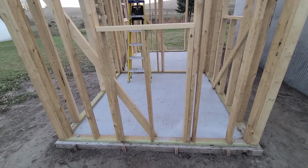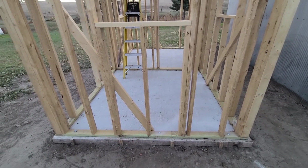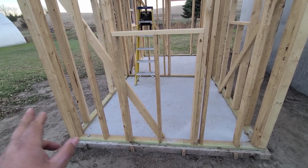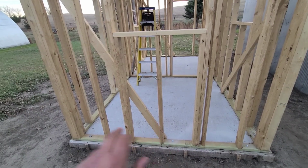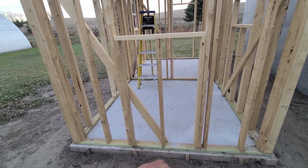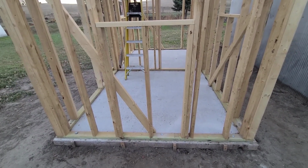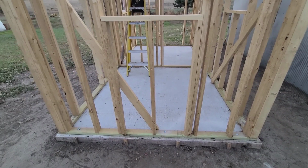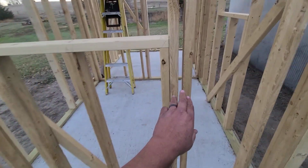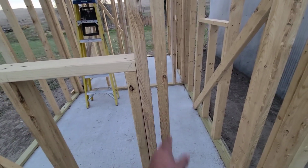So all of your buildings are either on a 16-inch center or a 2-foot center. Each of those at 4 foot ends up with a stud. So even on your 16-inch measurement, you're going to have a stud at 4 foot. On your 2-foot stud layout on center, you're going to have a stud at 4 foot. So if you know what kind of siding you're using, you can do that. If it's commercial construction, or you don't know what siding is going to be used, or you haven't decided, you've got to put these studs in here. So say this was a longer wall, say you left this stud out, you get down here to splice your siding and there's no stud here to splice on. So if you don't know, you've got to put all of them in.